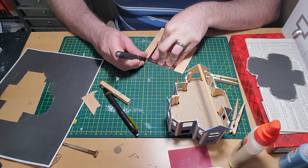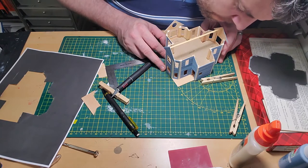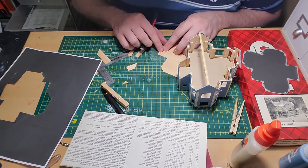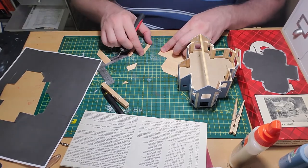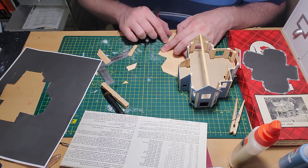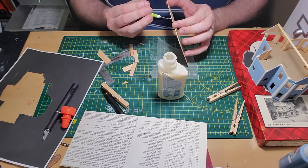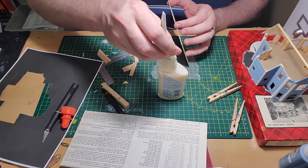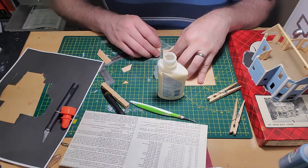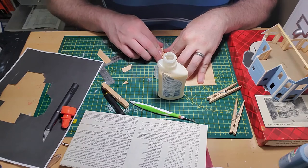Next is the other edge of the decking that needs to be cut. It's a back corner, so it's like a square, and I check that, and that looks good too. The back of the house overhangs on the back part of the decking, so I have to add some additional wood to the back decking area to accommodate that overhang. So I decided I was going to just add wood to it and then cut away because I tried to just add the cut pieces to it and it just didn't line up properly. So if I do it this way, I think it's going to be a little better. So I'm going to glue the pieces on individually and then wait for it to dry, being sure to weigh it down so as not to warp anything.